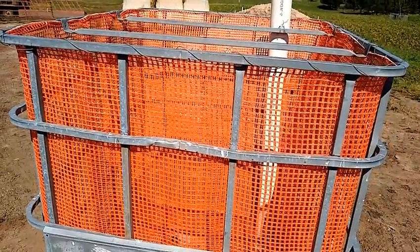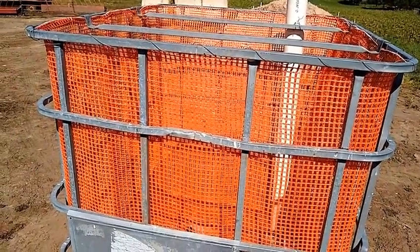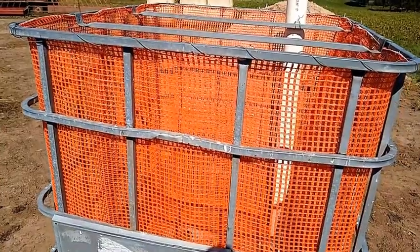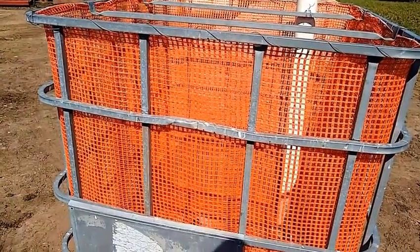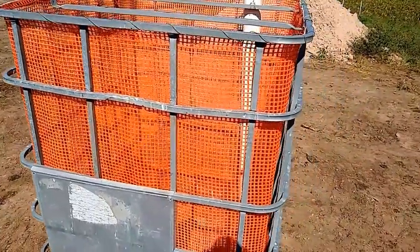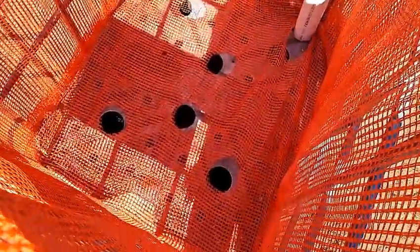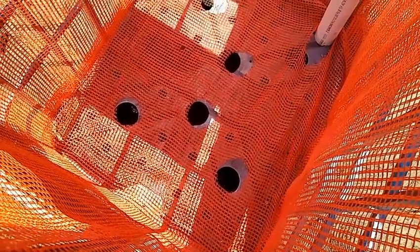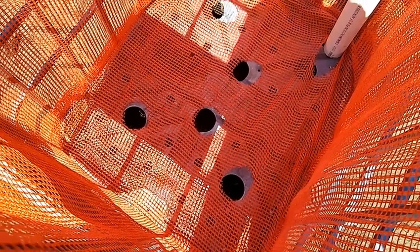In the bottom of the tote, I drilled out holes to receive the 4-inch tubing. You need to have a tube every 12 inches — no tube should be more than 12 inches apart and more than 12 inches from the outside. I want to mention David Young from Young Red Angus Farms — that's Y-O-U-N-G — he's done some really nice videos on YouTube, so I recommend you look that up. There's the bottom of our tote. I put some of that fencing on the bottom because of the additional holes in the bottom, since I didn't drill smaller holes to keep material from falling through.